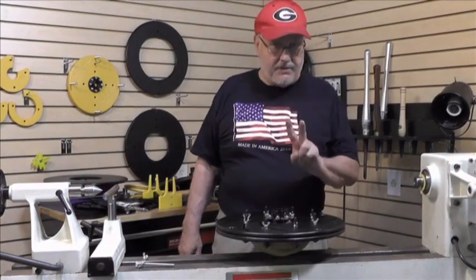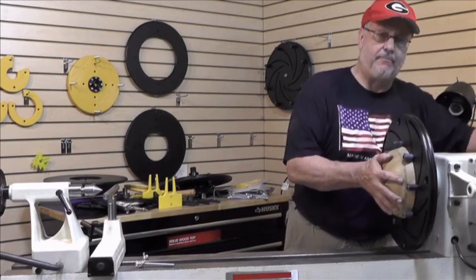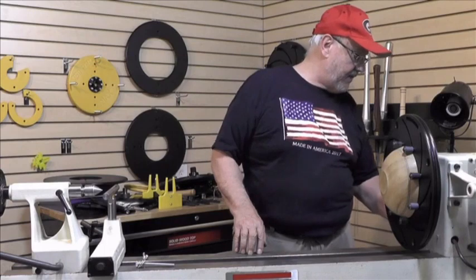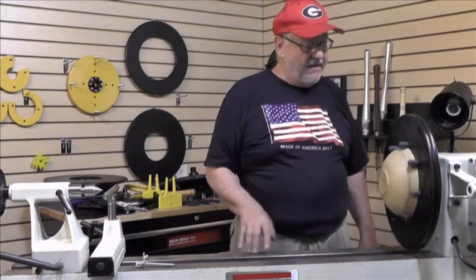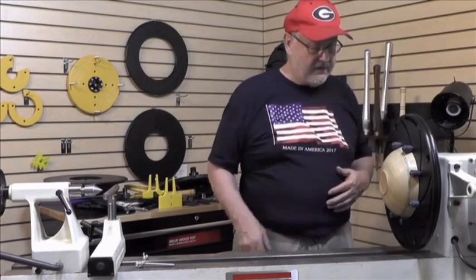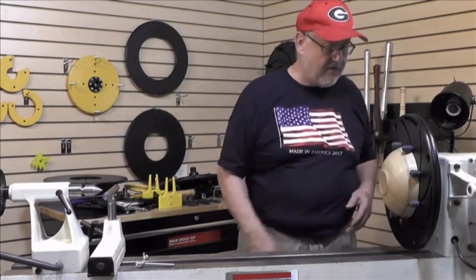The Longworth Type 2 has a faceplate that threads right onto the spindle. Longworth Type 1 you'd actually put in your four-jaw chuck. So that would be reasonably secure. It should be perfectly centered. Yep, just dead on centered. If you get a catch though, because of the nature of this, you're only holding it from one side, they do tend to vibrate, and some folks have had problems when they're coming out if they're not using the tailstock for extra security. And then of course that interferes with your final work.